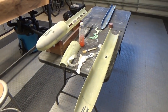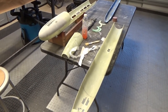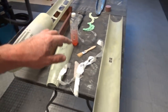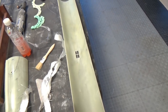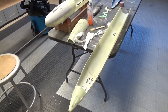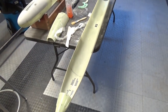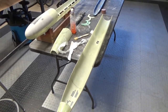Before I forget — I elected to put additional drainage holes in the middle of the hull. We had the rear section for drains and the forward section for drains, and I added four rectangular openings in the middle myself. I scribed those in, cut them out, and that'll allow the hull to drain faster and more conveniently — because both the front and back are actually higher than the lowest part of the hull, so you'd end up with water sitting in there. I added some additional drainage holes to prevent that.